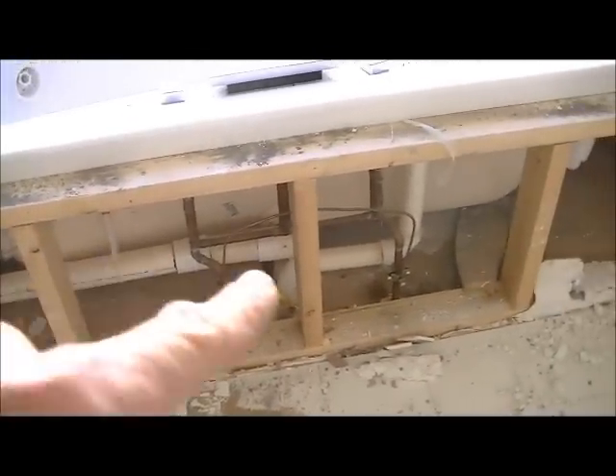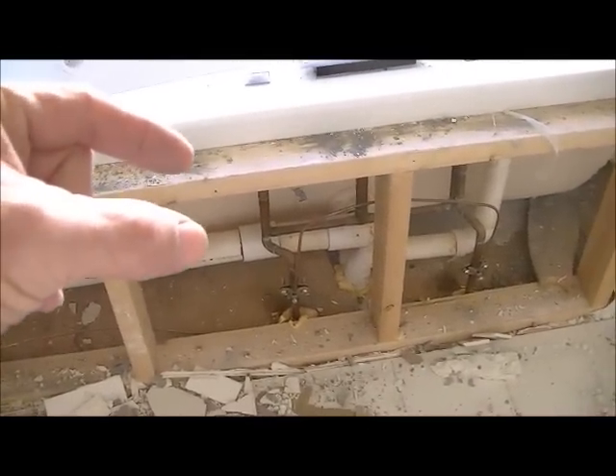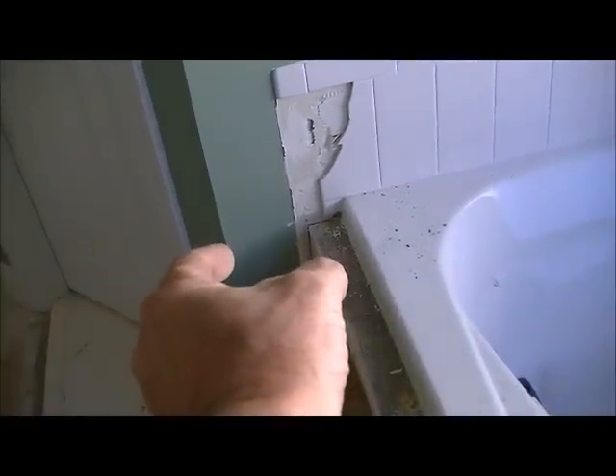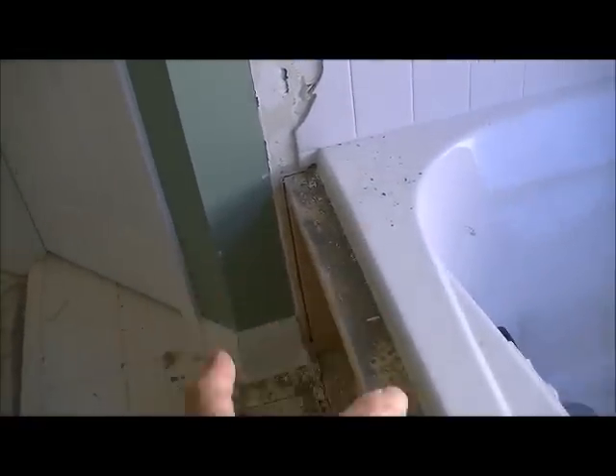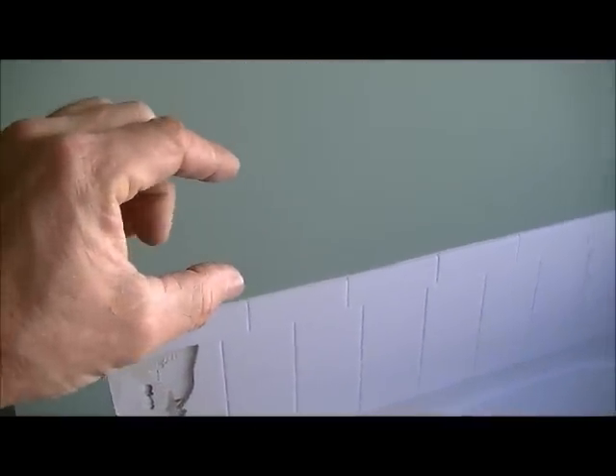The customer hasn't really decided on the design for sure yet, but I think I'm going to be putting the 1x1 on the face of the tub, 2x2 on the tub lip itself, which I'm going to extend out to that edge right there. So I'm going to get about another 3 or 4 inches out of this little tub edge. Probably do a 12x12 going up here, and then a 2x2 — two rows of it with a cap on top — the same type of slate, a really nice trim to go around.